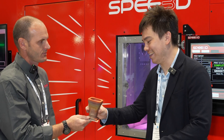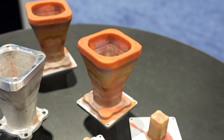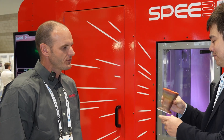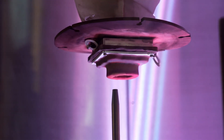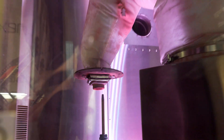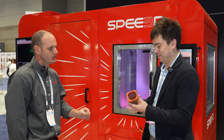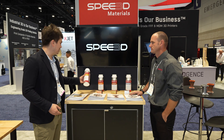Here's an example part we've been building at the show — it's heavy. What's going on with all the different colors? That's some surface oxidation. As the build progresses, there's high-temperature air and friction from deflected powder particles going across the surface. But if you cut through the inside, you'd see it's just as bright and shiny as a penny.